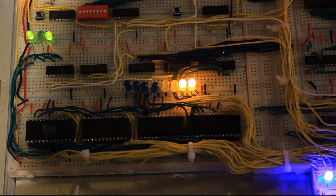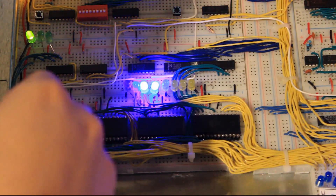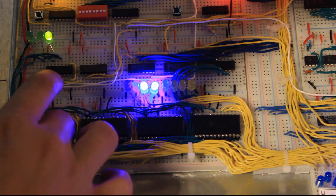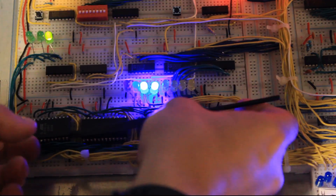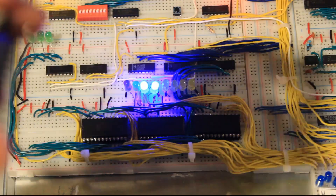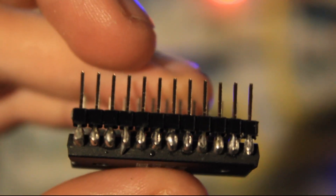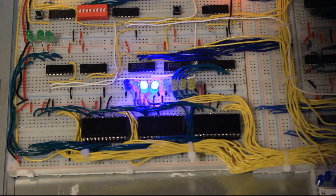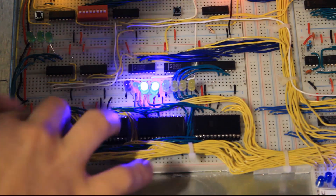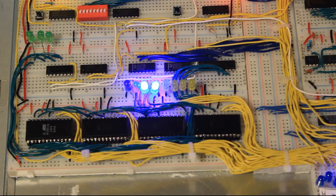The other thing to mention is the obvious modification I've made to these ROMs — they don't look like normal ICs. I've had to make modifications so I can insert and remove them much more easily when reprogramming. I cut the pins off and soldered male headers onto what was left of the pins to make them more rugged. If you're going to be reprogramming your control ROMs a lot, I highly recommend this modification — it prevents a lot of issues and helps them get better contact with the breadboard.